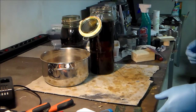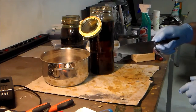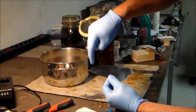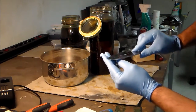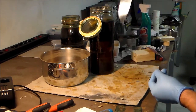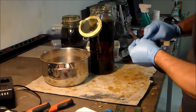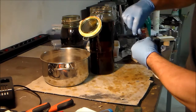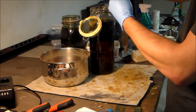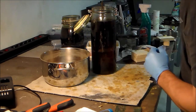Hey guys, I don't know at this moment how much you saw of the previous part because the batteries died while I was filming it, but as you can see, I've reshaped the blunt point into a nice knife point. So what I'm going to do now is etch this in ferric chloride. Only if I do a straight razor, there's a convenient pivot hole. I've set the pivot hole in this one open too. So, I'll basically hang it in.